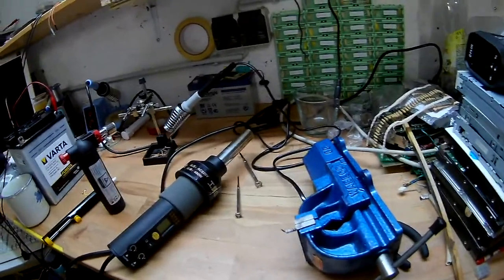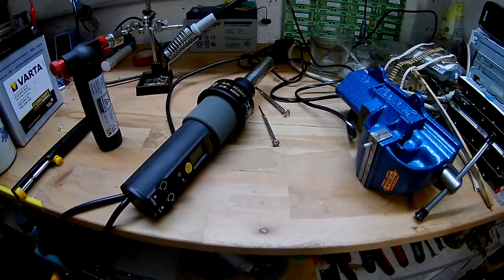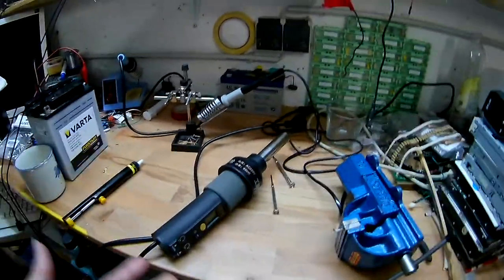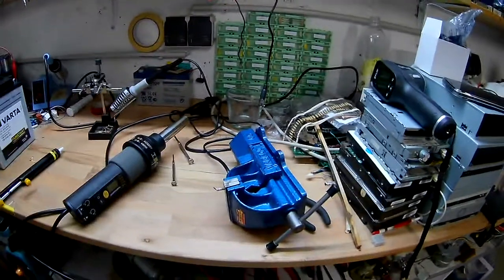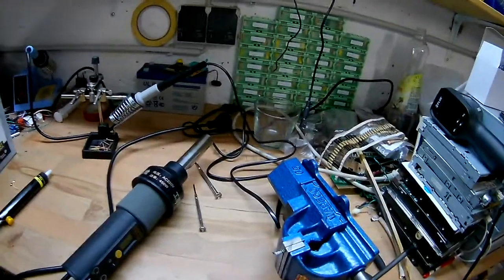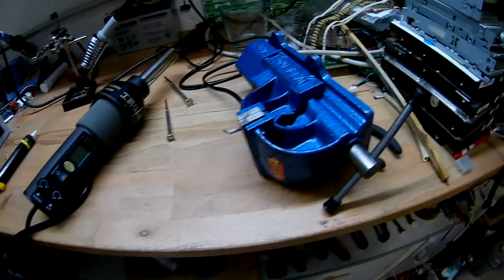So yeah, that's probably how it looked inside this thing before it went pop. But I guess it went pop for a reason — if this thing draws 200 watts, this blows up. I don't really have time to reverse engineer this, but I'd like to look at what other components could pull so much power to blow up that resistor, because 200 watts in idle just doesn't make sense. I think because it exploded so violently, it actually really acted as a fuse. The new one didn't blow up. I guess there was a short in a semiconductor that caused the explosion, and due to the high current flow it also broke a bridge in a semiconductor.